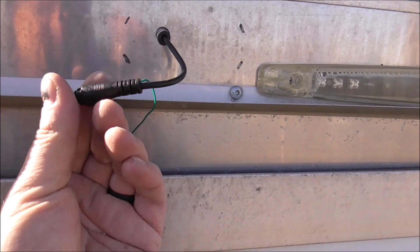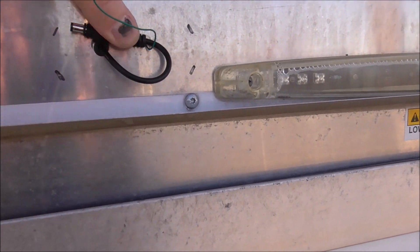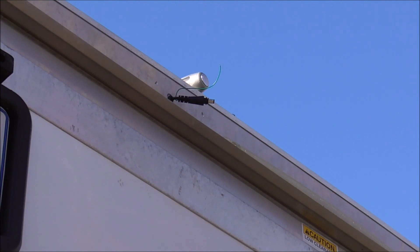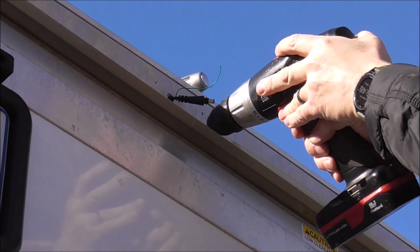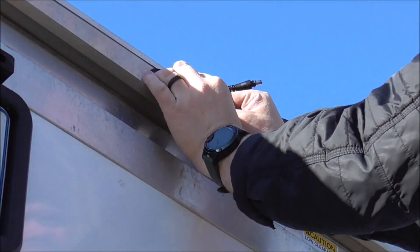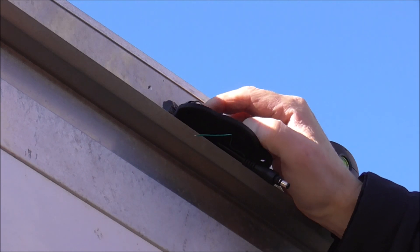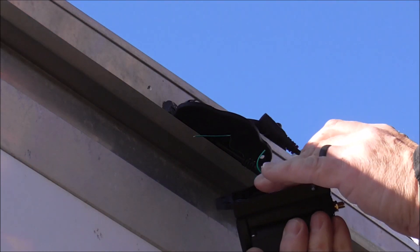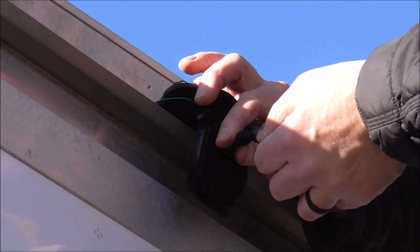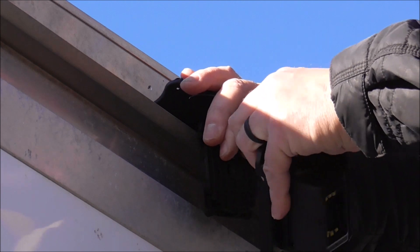I'm going to leave about three or four inches outside so the wire can make a nice comfortable loop inside that housing. Now I've got to drill it out for the mounting screws. We'll slide the gasket over this piece — that's going to help ensure it's sealed even more. I put a little bit of black RTV silicone in there just to help seal things up. Got all the spare slack in the back of the camera, then hook it up — it's a twist lock and it's also got an O-ring on it as well.